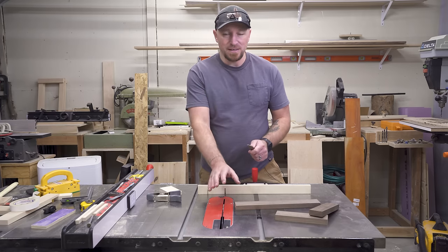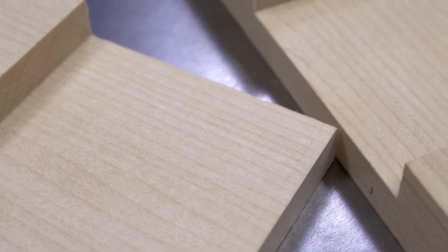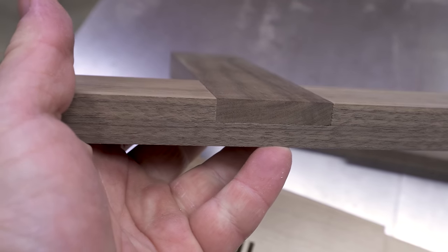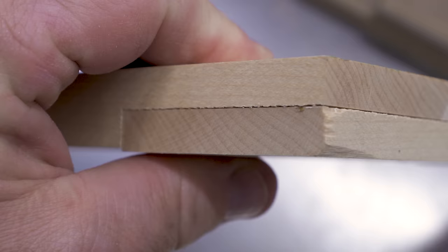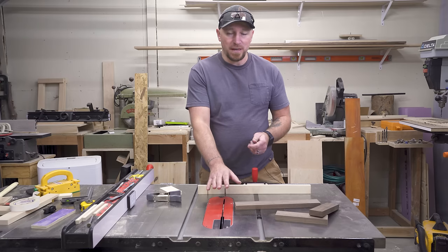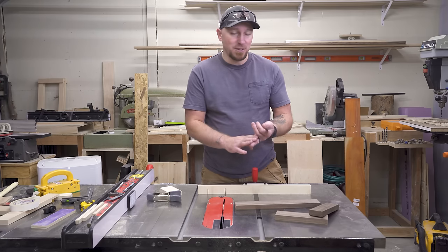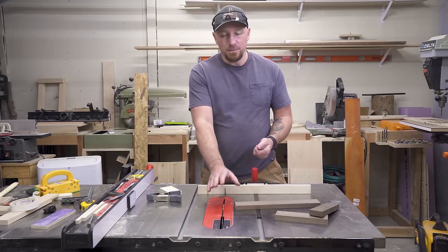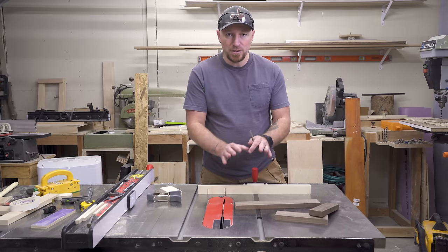Now speaking of this saw blade — this is a specialty ground saw blade that is going to leave us with a flat bottom when we cut, glue ready right off the table saw. When you're using a normal blade with different angled teeth, it leaves a rough surface and you have to come back and plane, chisel, or sand down all those peaks and valleys. That's not the case with this blade. I bought it specifically because many of you have said a dado stack isn't in the budget, your table saw doesn't take a dado stack, or you can't buy one where you live. I'll leave a link down there if you're interested — it leaves a really nice finish right off the saw.